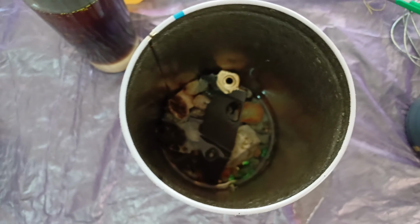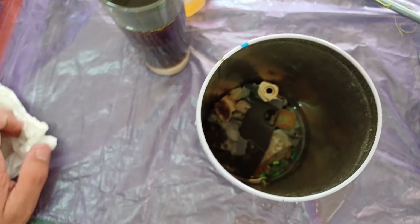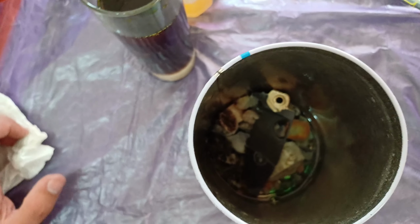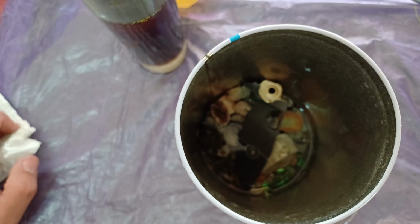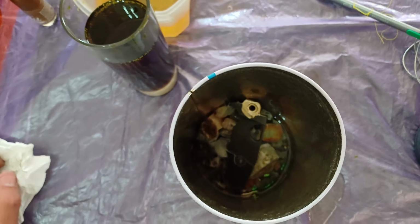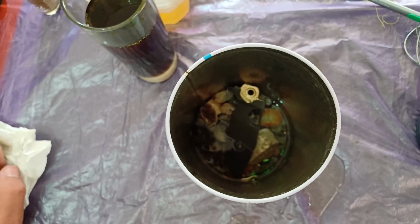And we're going to gently shake it, right? You don't want to aggressively shake it at all, or you'll get deep scratches and some inconsistent markings on the blade. So just gently, in a stirring motion, move the container for about 5 to 10 minutes.